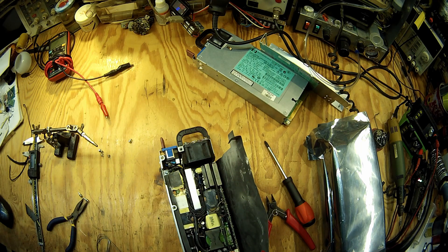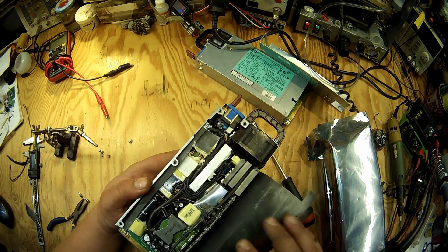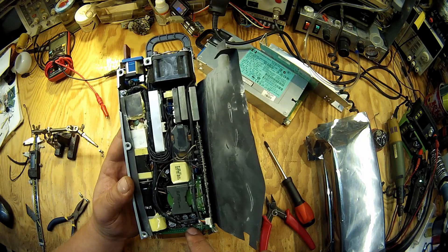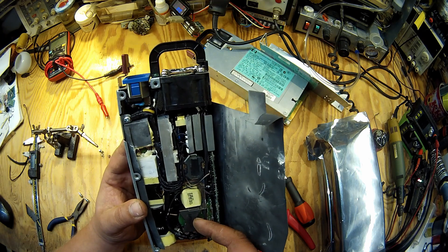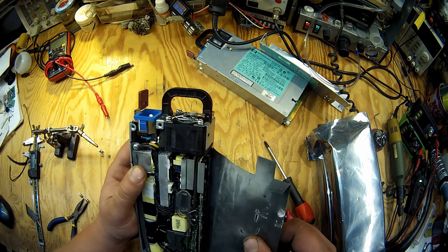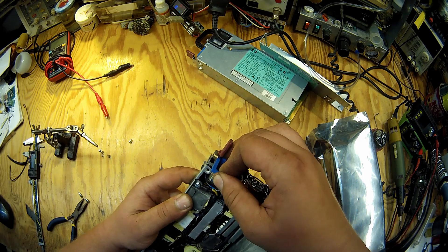The reason I've chosen this power supply is because it's an amazing quality power supply. The construction is very interesting — instead of output diodes it has MOSFETs for synchronous rectification. It has a really funky setup on the main transformer, it has high power, it has power factor correction, and the efficiency is amazing.